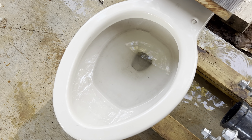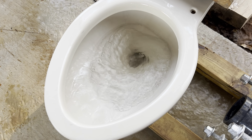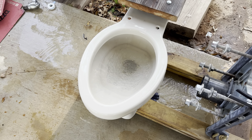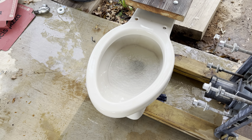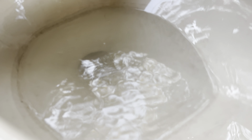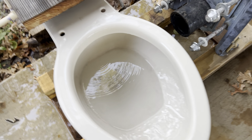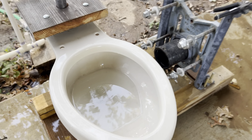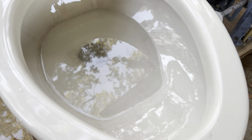While I was waiting for the tank to fill, I looked on the Home Depot app, and my Home Depot actually has a couple pressure tanks in stock. So what I think I'm going to do is get a 32-gallon and connect it to this 20-gallon one. That way I have a 52-gallon tank, which should be plenty for 3.5 toilet videos, because the 1.6 toilets are fine — they don't use a lot of water, so I only have to wait maybe 10 seconds and it's ready. But the 3.5 ones take a lot longer.